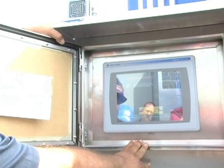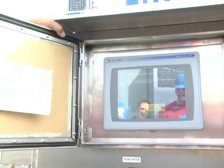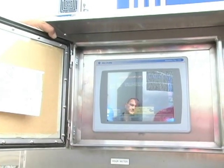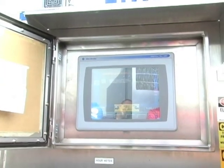We've got a couple of alarms here — we have blower placed in service mode, so if it's put into service mode, you're not going to be able to start it until you put it back in normal mode. And we have a skid-mounted e-stop — somebody's pushed the e-stop on the blower inside the enclosure.